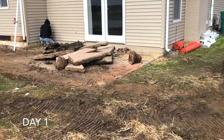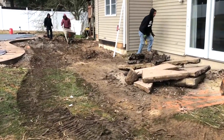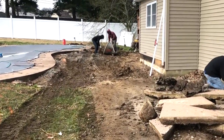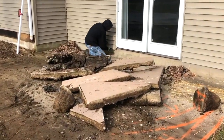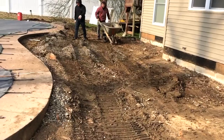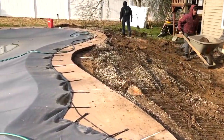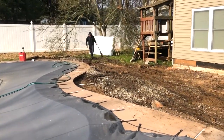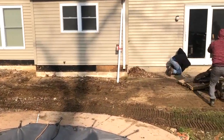Day one. Well, actually, day one was removing the deck. Retaining wall here, patio, retaining wall on the opposite side. And because we want to walk out this back door here, we're going to put a small deck drain along the house because we have about 1 3/4 inch pitch. We don't have any issues down the road. So my goal is, today's Tuesday, the weather stays nice finally. We'll finish this Saturday.